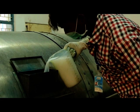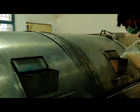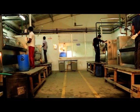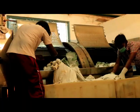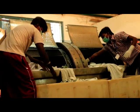To still achieve a strong color fastness, after all, a combination of pigments and reactive dyes will be used for the dyeing process. The process of pigment dyeing is applicable to nearly any kind of textiles, even synthetics or blends. It is cheaper and requires fewer toxic chemicals, some of the many reasons why it is one of the most popular dyeing techniques nowadays.